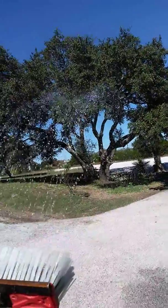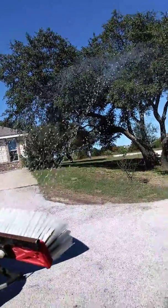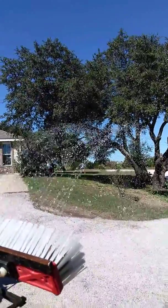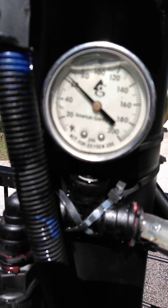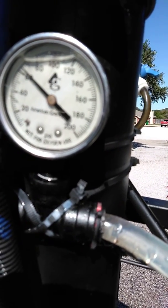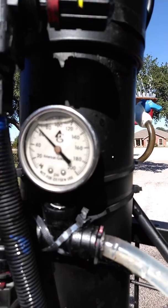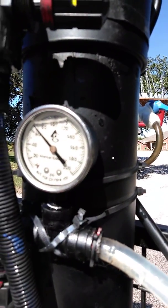That is what the booster pump will do. If you're looking for a booster pump, the Wayne PLS is perfectly capable of handling the job. Just boosted, let the pressure equalize — unboosted, you're getting about half the spray. It went from almost 110 down to 60. That's a 40 to 50 PSI boost. Overall system boost is up to 80, but working boost is a 40 PSI difference from working boost to actual system pressure. Because there's two different pressures — you've got what it's doing while it's working, running, permeating, and wasting. Then you've got another where it's boosted doing all three.